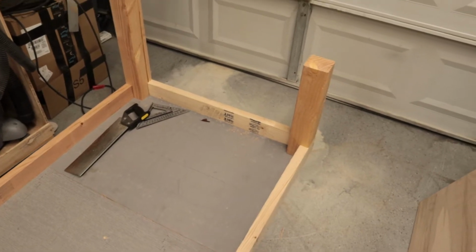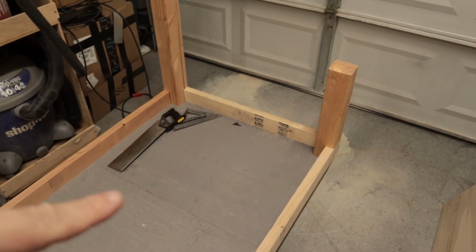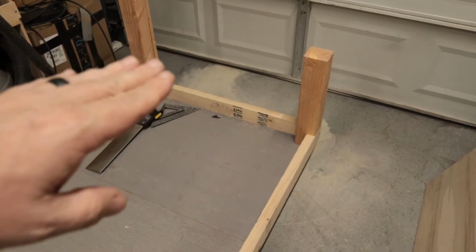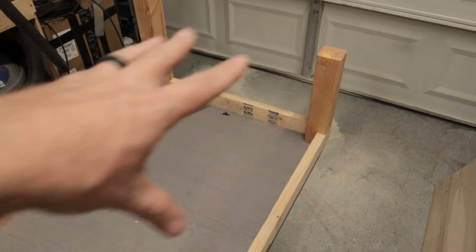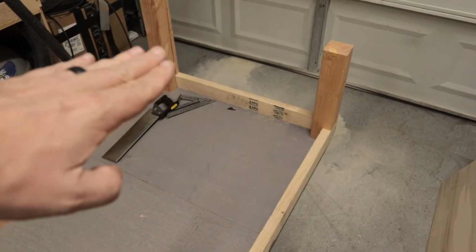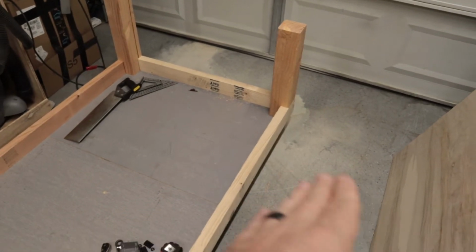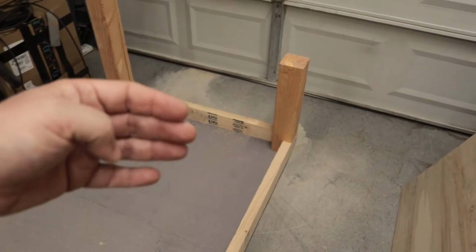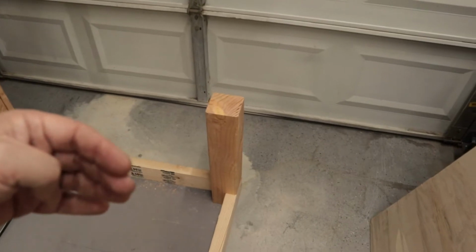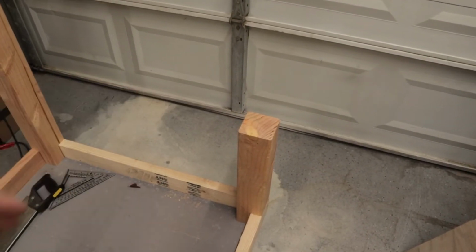So the next step is going to be working on the plywood box platform for the table saw right in that area. It's going to be a 3/4 inch piece on top with some 1/2 inch sides, and that's going to leave me some room underneath to add some drawers. And I'm going to recess the side in from the edge of the overall workbench.